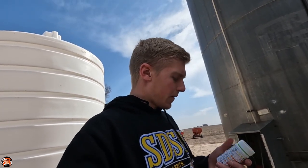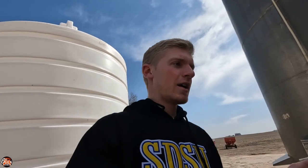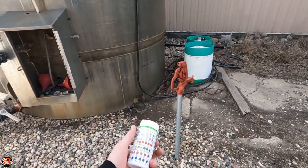At South Dakota State University I'm taking a class called Implementations of Chemical Applications — super good class. We talk about sprayers, how all the plumbing works, different types of nozzles, how to calculate everything. Right now we're talking about water and chemical mixtures and the order you should mix everything. Hard water is a big problem when spraying chemicals, especially glyphosates, because they like to attach to the calcium in hard water and then it becomes too big to be absorbed into a plant. We usually add AMS, a water additive that binds with the calcium, so glyphosates and chemicals like Roundup can be free. They gave us this pool testing kit so we can test our water's pH and hardness, then report back and make an Excel file comparing everyone's water. This is where we get all our water to spray chemicals — I'm going to do a water test on it quick.